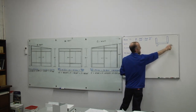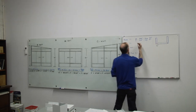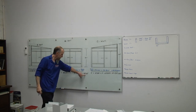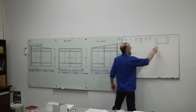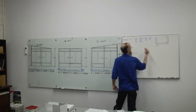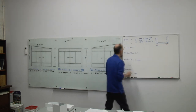Make sure we have our leg to the outside — your A wall and C wall will both be holding an angle. For the B wall, we want our base f cut at 187 and a quarter, from the long to the long of the 45-degree angle, again with your half-inch leg to the outside of the roof.